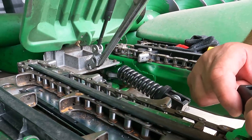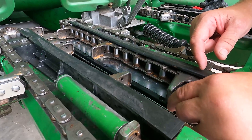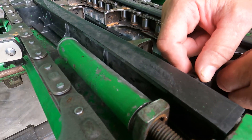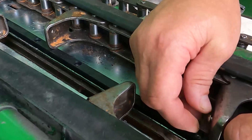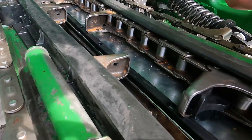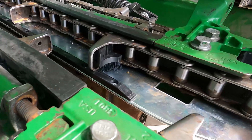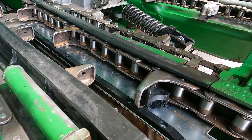After that rail is riveted down, the next step is to install these brushes on the gathering chain. Each kit comes with enough brushes for your gathering chain — you'll have a right brush and a left brush. When you put the brushes on the back side of the gathering chain, you're going to see it sits pretty square. Install the brushes with the included hardware: a panhead bolt and a locking nut. Repeat this process for every finger on the gathering chain, and each kit comes with enough brushes per gathering chain, as well as two rails to cushion those ears and lessen corn shatter.